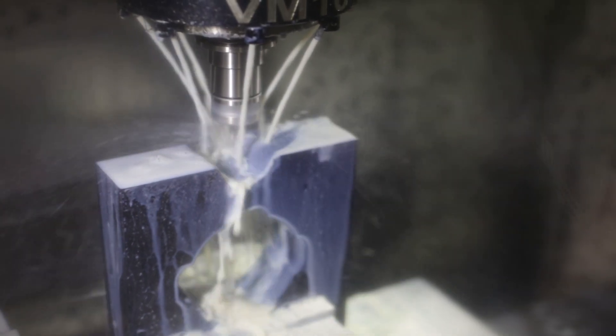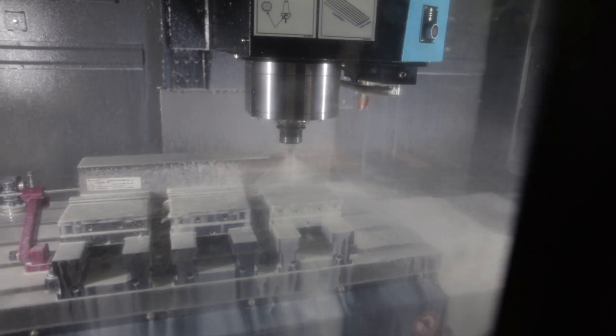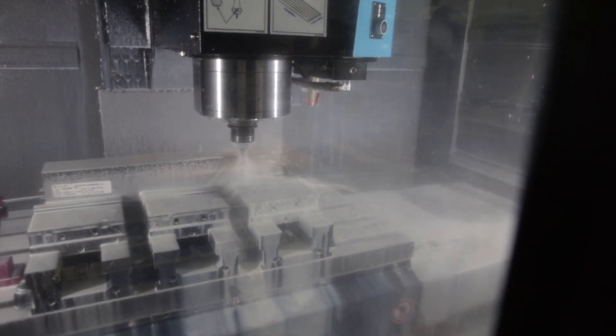The VM10s are an excellent general purpose mill. About 80% of our parts we make on the VM10 — it's a perfectly great machine for it. For the VMX, we specifically do die blanks, which is basically a 60-pound hunk of stainless that we need to poke holes in and cut the outsides, flip and face mill, and all that stuff.